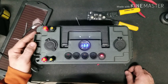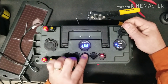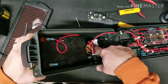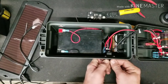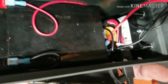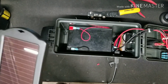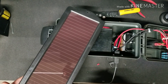We switch on our power and we still have everything working — front lights, USB, cigarette lighter, and your power posts. Now if you look at the charge controller, nothing is lit up on it because a solar panel isn't connected. As soon as you hook up a solar panel, that middle light comes on showing charging. It's extremely dull because this small solar panel isn't in direct sunlight — it's just for demonstration purposes since it fits on the table.